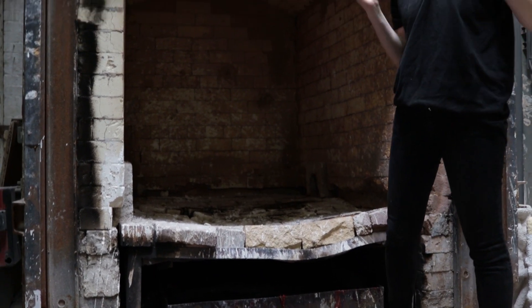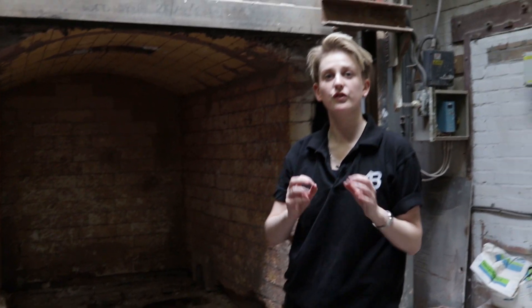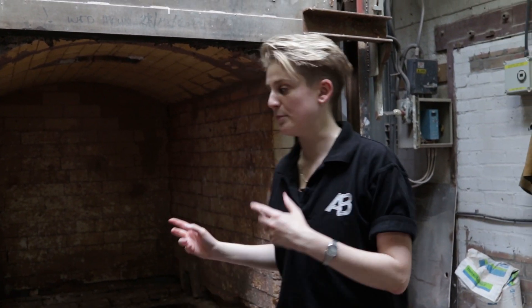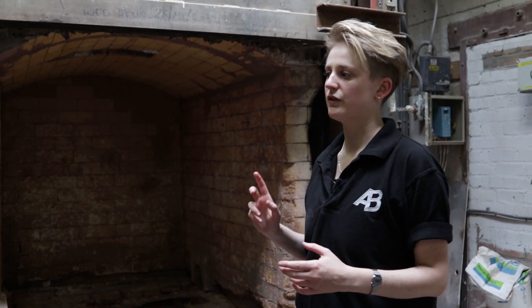Once that's happened it comes out of the kiln and gets reinforced. Sometimes when the ceramic's been fired the first time you might see hairline cracks in it — that gets reinforced. We use a thicker version of the ceramic we call a putty; it's quite a gloopy version and we stick it around the edges or on the cracks or wherever we think there might be a weak spot. Then it comes back into the kiln for its final firing at 900 degrees.